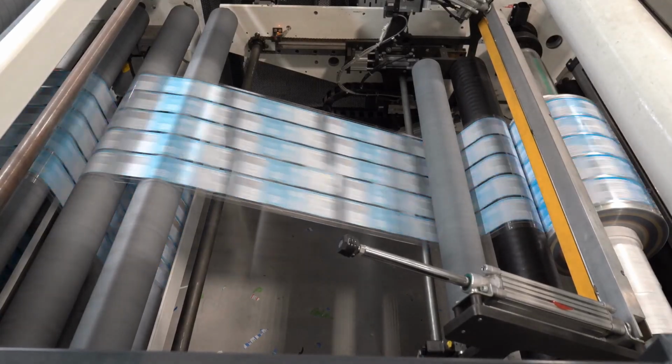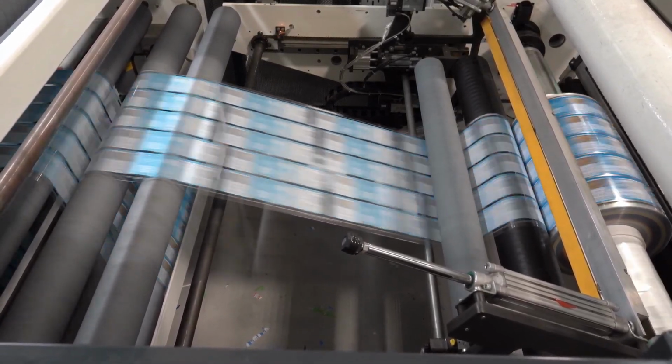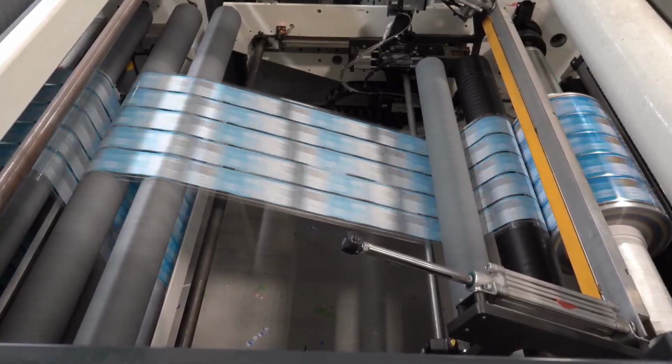The data matrix contains the barcode number with high error correction rate, but it's invisible to the human eye and no artwork needs to be redesigned. The extra layer of UV ink is a low-cost addition to the label design and requires nothing more than an extra plate on your label press.